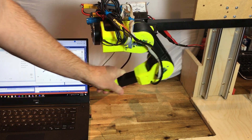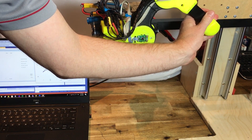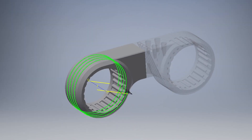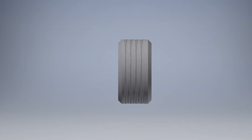I wanted to make the part even stronger, so I tried a technique that is used in concrete construction, which is pre-tensioning and compression. The plastic has opposing spiral grooves, and the spiral stopped the cables from breaking through the layer lines.